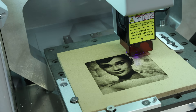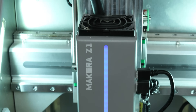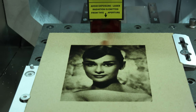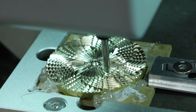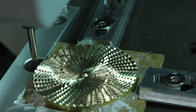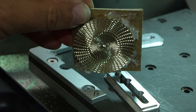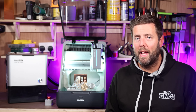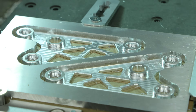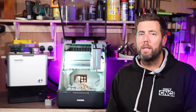The laser is five watts, which is basically an engraving laser — it's not there for cutting through material, though it may just about cut through some thinner material. Its purpose is engraving. I've actually had quite a few watchmakers reach out to me about this machine. I ran some tests on brass coin faces to try and imitate what watchmaking results may look like, and it handled that absolutely fine. In terms of accuracy, as I said earlier in the video, this is accurate to around four or five hundredths of a millimeter. If that is within your tolerance, then absolutely this will do the job for you. If you are working to finer tolerances than that, then this might not be the machine for you.